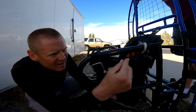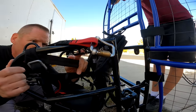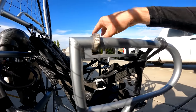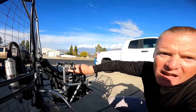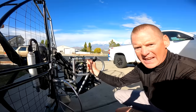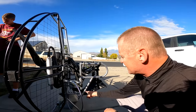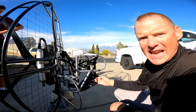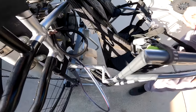Look how thin this metal is and how thin these points are — you don't have enough metal to weld onto. With the flat top there has to be sufficient metal here. It balances perfectly fine even for very light people, which is why my son set the world record at age 10 flying the unit. You have to have enough metal to get a good weld, and thicker metal because you just don't have the strength otherwise. And look at the offset on the bars — experience knowing that when you do tandems or stand up and spread your legs, your knee needs access and recess right there.